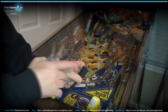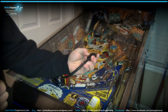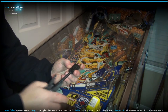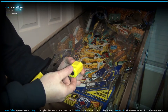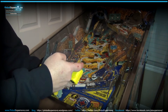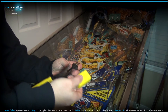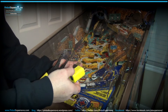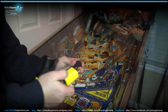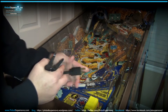On my plug, the bottom part is where the ground would go into the wall. The right side, where my pointer is, should be the hot side. When putting wires into the new plug end, I need to match that up — the power side is on the right, so whatever wire comes out of the right side has to match up to that side on the new plug. Now we're just going to cut it.